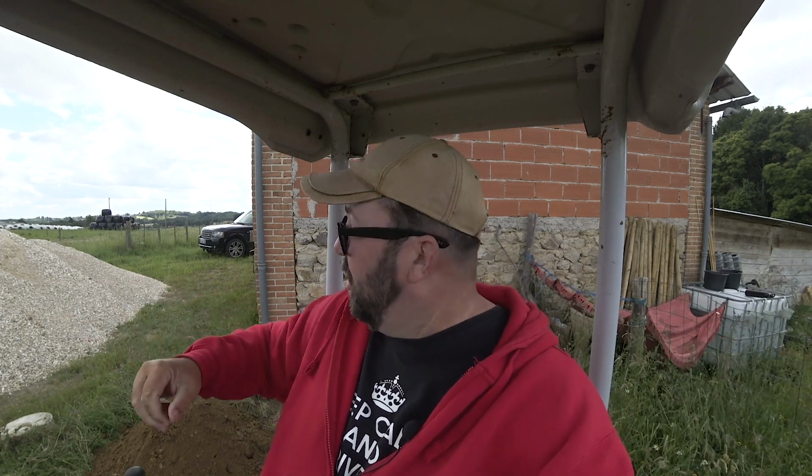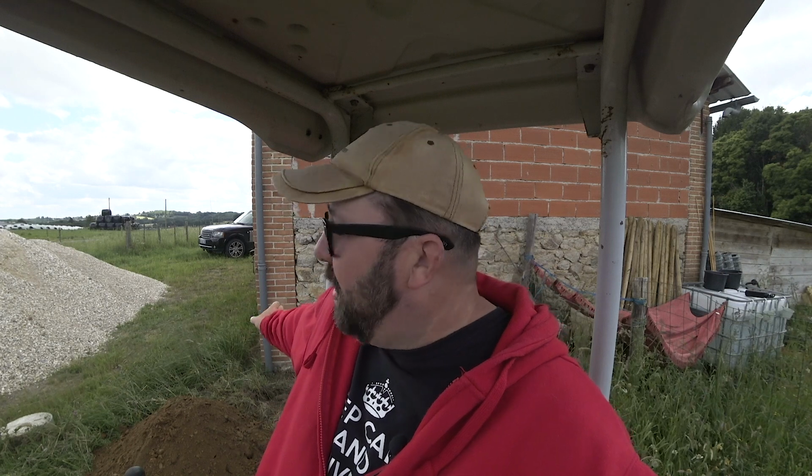Now, we've already dug the floor out in the garage. We've got to scoop some of the loose out and just get Tina to dig some of the loose out from around the sides so I can oik it out and we can get rid of it, because you can't really compact dirt. Once we've got all that out, then I'll probably dig the trench first. I'll just measure from the corner of the wall here, so I can dig the same trench on the inside and then go to where we want the water and the power to come up out of the floor.